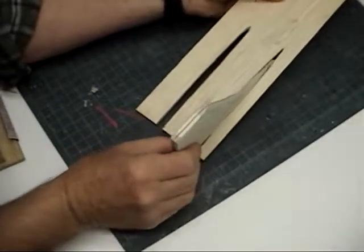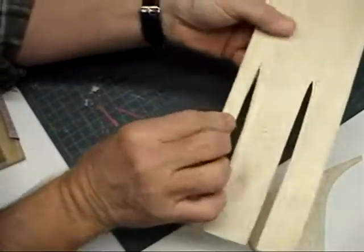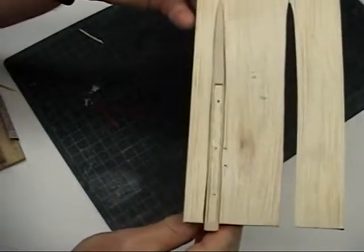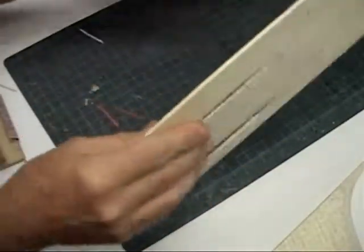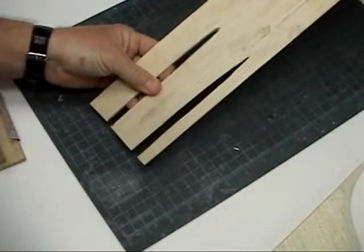So now we have a good pattern. Now we know, and I'll leave the incline on, get the length just right, back cut it, and see with the back cut in there, when this slides in, I'm getting even a better glue joint. It'll be a lot better. So anyway, that's the trick of the morning, and if we can get this set in place, having that template is going to be a big help.